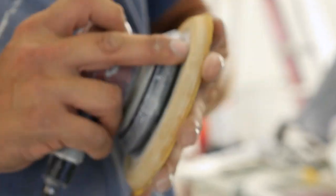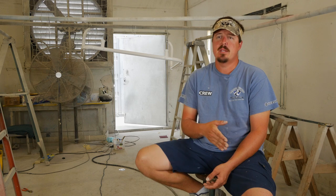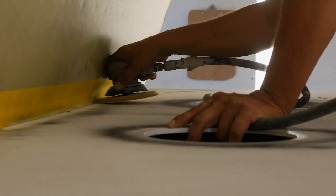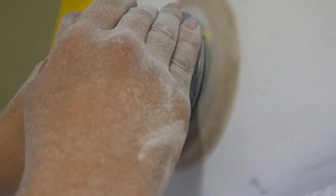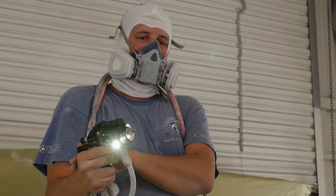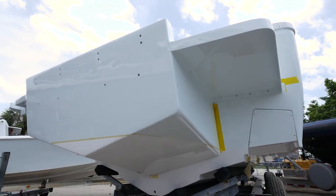When we get the Armstrong brackets in for a paint job, I trace them out and start sanding everything down with 320. One important thing I did was knock down the non-skid line. Armstrong had like a three-quarter-inch quarter, but this whole boat's got a half-inch quarter, so it'll be stepped back a little bit — you don't want a hard line anywhere. With this bracket being brand new and freshly painted — only a couple months old — once we're done sanding, it's a finished product, so we don't have to prime it. I went straight into paint. It was getting dark so I put the light on. Just like any other paint job, you really got to watch where you're at and make sure you've got it fully covered. All in all, I think it turned out pretty good.